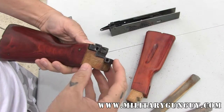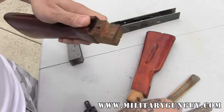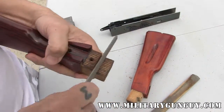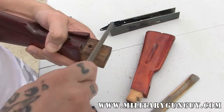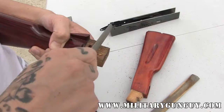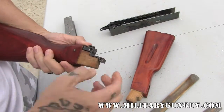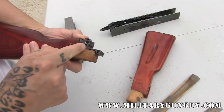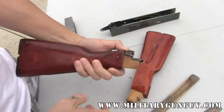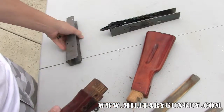Okay, a little bit better. Not too bad. A little bit better there. Sometimes you may have to even angle it and give it a bit of an undercut, because those trunnions are kind of cut at a slight angle underneath. You can see where it's not straight — it's actually cut at a little bit of an angle. Hopefully I'm showing that in the video. And again, you can check your fit.